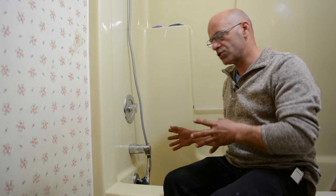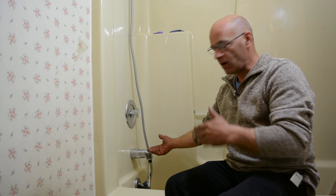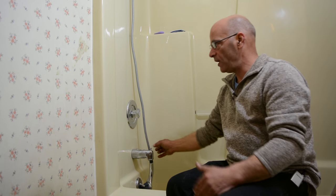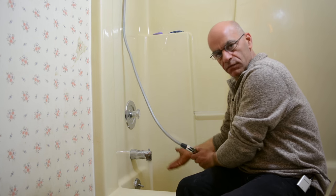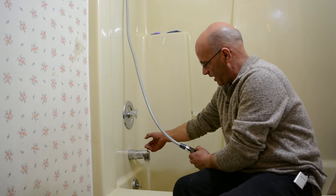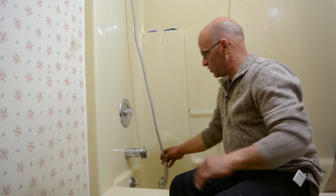I'm Dominic. In this video I'm going to show you a problem we're having when taking a shower — we're not getting a crazy amount of water pressure in the shower head. In this particular setup, our tub spout has a little blockage: we pull this up, it blocks the water from coming out the tub spout and sends it up through the shower head. But right now we're getting half out of the tub and half out of the shower head. We want to remove and replace this whole tub spout.